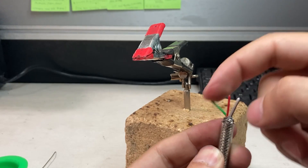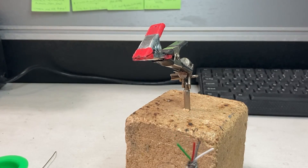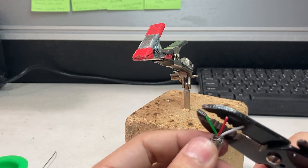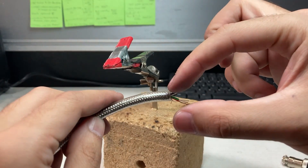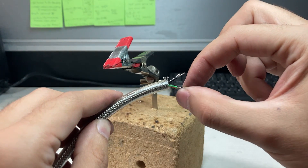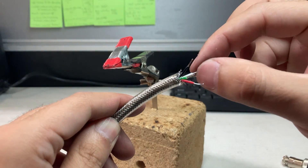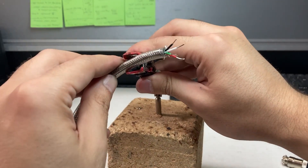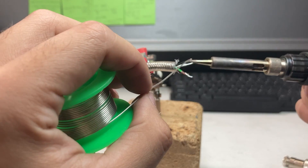Separate them out. It's a good thing to check, because if it's too long you just have exposed wires. So you're going to take your wire stripper now. It took me a couple of tries, but I finally got the proper length. Sometimes you might cut one of the cables off by accident or strip it too far. Just make sure all the wires are good. Twist any bare ends. Put it on here and then take your soldering iron and actually put some solder on each end.